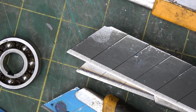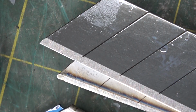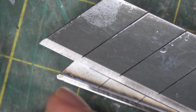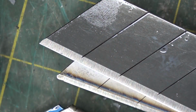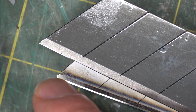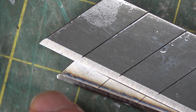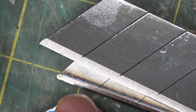With hardened carbon steel knife blades, they can use any old rock. But with carbide, they need to use diamond. Now, the failure mode of this, what these are allegedly is you have carbide particles that are laser sintered onto the blade. But it's not the carbide that fails, it's the substrate that fails, because the way you use these is not just for cutting boxes. It's for hacking shit up. It's for throwing around. And you end up chipping the blade. So the carbide doesn't help you in that case.